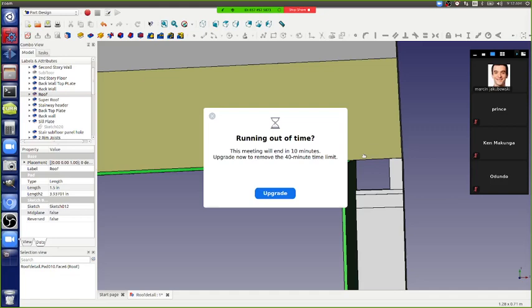Back of the envelope stuff tells me, yes, that's going to be fine, not a problem. What's the compressive strength of wood? It's several hundred PSI. You're not going to squeeze that by putting a roof on that. Even if you've got like a foot of snow or 2 feet of snow, that's not going anywhere.